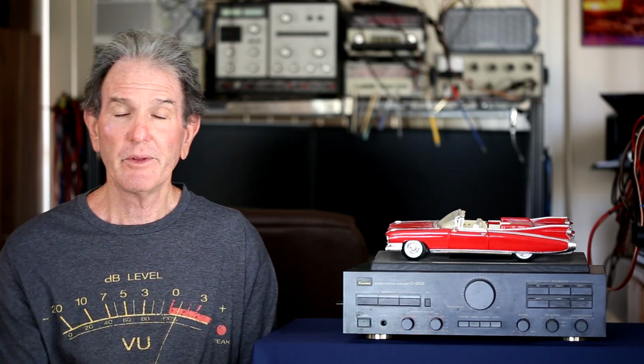So normally if you press in the equalizer circuit, you would like everything to be flat. This one wasn't really flat, but if you're going to be using the parametric equalizer, you're going to be adjusting settings anyway, so it's not really important that it's not flat. It's more of a, oh okay, this is what it looks like. On certain preamps, it'll look not much different when the equalizer is in and out. So overall, I thought it performed electrically really nicely.